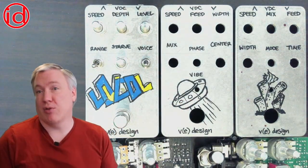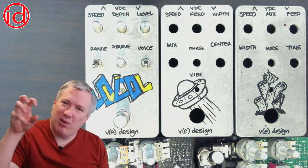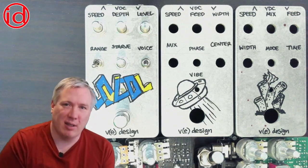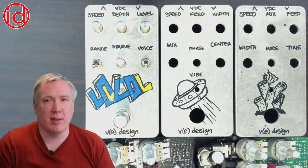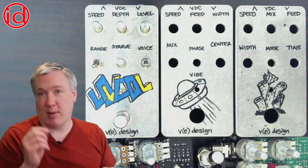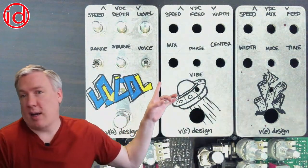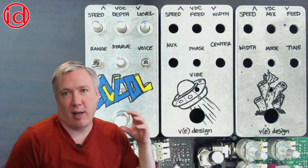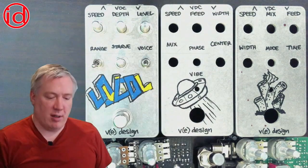The main design goal in updating the Tractor Beam was to create a true depth or width knob. All the previous versions had a pseudo depth knob that was more like a center knob — it didn't act like a true width of the phaser sweep. That was the main thing updated here, and I took away the phase switching knob because if you can control the width you don't need to change how many stages there are. I'm also tuning it right now to make sure I can use a lower-noise design while still having that same phaser sweep.